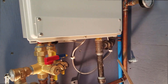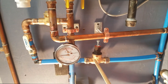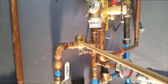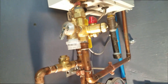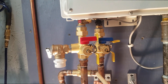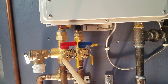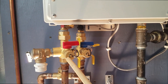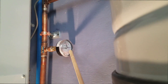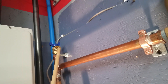In this system, we have our cold water coming in, it comes to a T, goes through a pressure regulator set at about 15 pounds of pressure, comes up through an on-off valve which allows me to turn off the water, goes through a one-way check valve, and then into a T which goes up into the water heater. On a tankless unit, you should buy valves that allow you to turn off the water from the heating system so you can hook a garden hose and flush the system with vinegar to clean out the heat exchanger — you should do that about once a year. Once the water is heated, it comes out of this pipe, and you need a temperature gauge so you know your temperature and pressure coming out of the system. I have a bleed valve right here so I can bleed the system quickly.